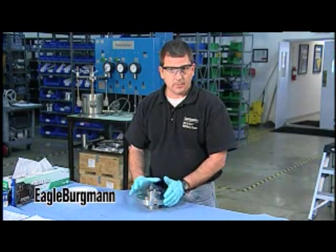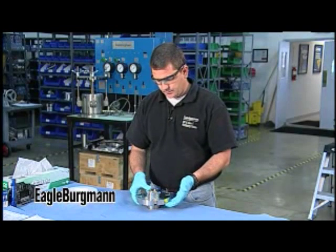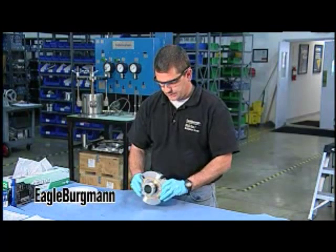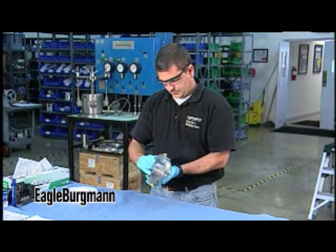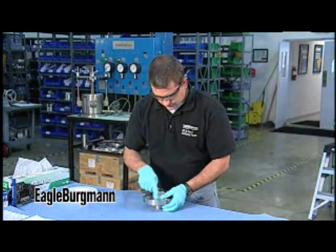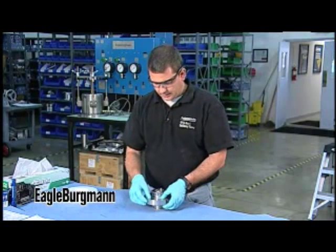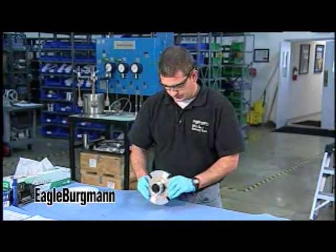For seals that go on between bearings and pumps, they might be rotation-specific. In that case, you want to know first of all: is it the clockwise or counterclockwise seal that I'm dealing with? Do all the parts match up? Usually what I do as a matter of course is record whatever information is written on the flange — for this example: 0038 Bergman Cartex ABDN, 1.750 inch. I always record all that information as a standard practice.